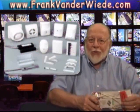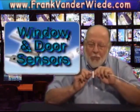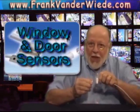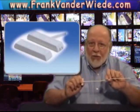Let's start with window and door sensors. Your do-it-yourself kit comes with a package of 10 all-purpose sensors. They can be mounted on a window or a door. They're simply a magnetic switch embedded in a plastic shell and a magnet in the second shell. They have peel-and-stick strips on the back of each one. You would mount the switch either on the window frame or on your door frame, and the magnet would go on the movable part. When the system is closed, they would line up next to each other. When the window opens, the magnet would move away from the switch and it would in turn send a signal to the alarm control that that window's been opened. These particular sensors are of good quality because they're already sealed and the wire is already attached, so you don't have to worry about attaching any wires.